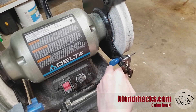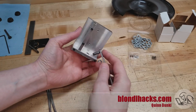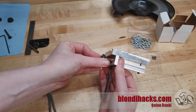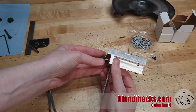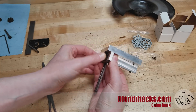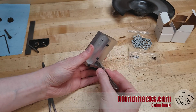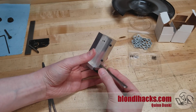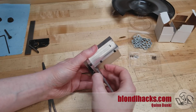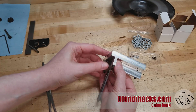The nice thing is you can tell already these are going to work great. I can actually feel them lock in — when they get tight it almost feels like a pawl and ratchet mechanism; you can just feel that's not going to loosen. That really works very well. Now what's the bad news? If I assemble the riser and the platen and put the thumb screw on, these two surfaces against each other are smooth and there's so much leverage that there's just no way that's going to stay tight — it's going to vibrate loose. I think I need something in there that's going to keep that joint high-friction so the thumb screw can do its job on the outside.